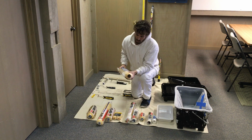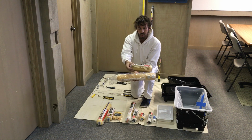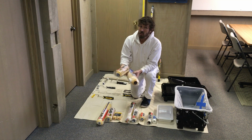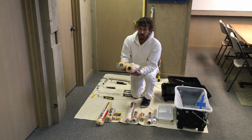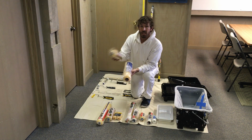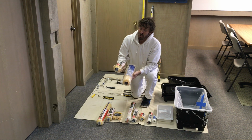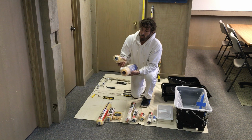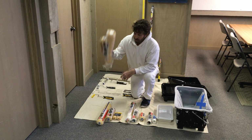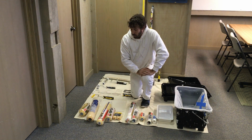On this 1.25-inch thick 18-inch cover, we also have a 9-inch, so that'd be 9-inch length with the same thickness, 1.25 nap. We typically only use these on exterior. However, we would use these on interior brick fireplaces or block that had some very deep recessed areas that had mortar. But mainly exterior stucco, really rough siding if we're back rolling after our sprayer. These are typically for exterior use and interior use once in a while if we're dealing with some interior brick.